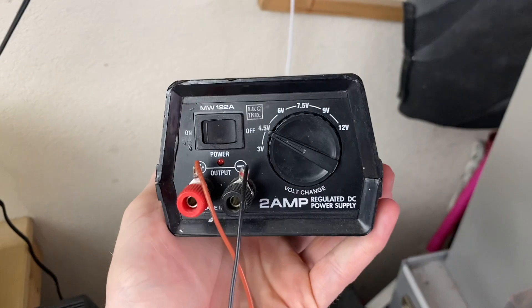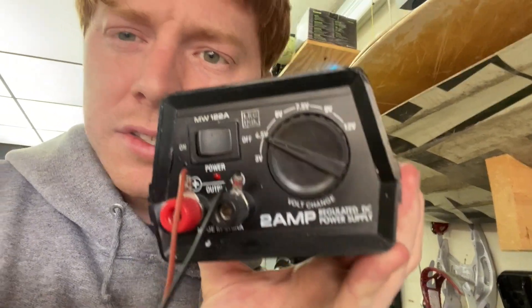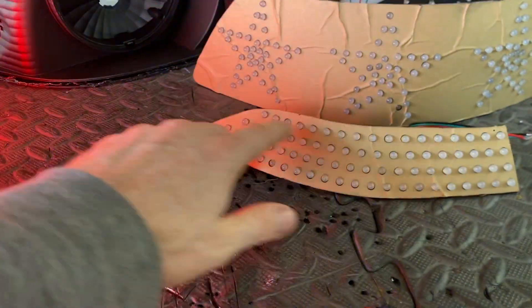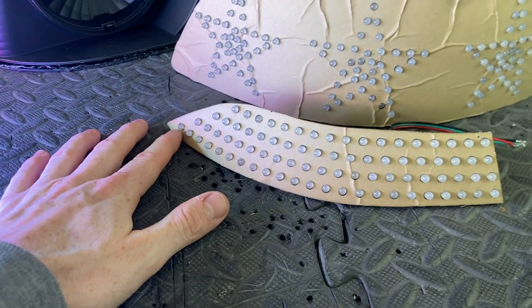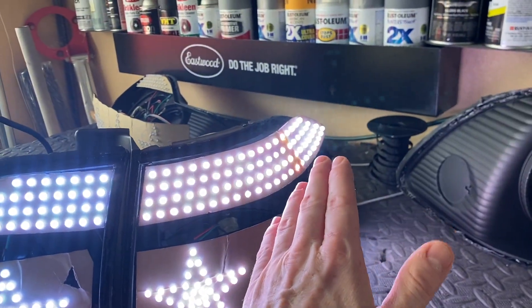Stop Motion and Simply Adjustable asked what power supply I was using. I showed them — this is what I've used for everything up until now, and it says two amps right there. That's a problem. We need at least five amps to push through the entire board and get through all the LEDs. So I was done messing around — I got one that's pushing 15 amps and stopped using the small tester.